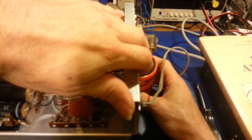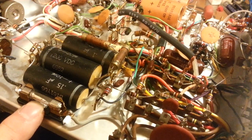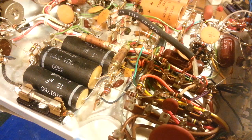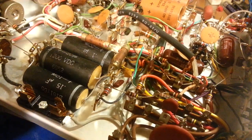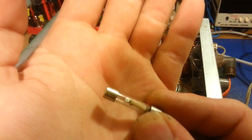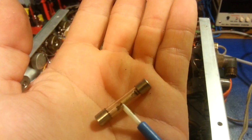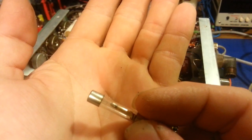The problem appears to be this fuse right here. It didn't actually blow — it looks like from age the solder deteriorated. This is a slow-blow fuse and the wire is so thin, but I can see that the solder just gave way where that wire attaches. You can see it bouncing around in there — it actually flaked off, so the fuse didn't blow, it just kind of fell apart.